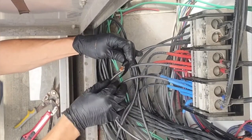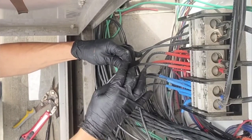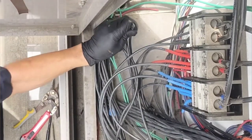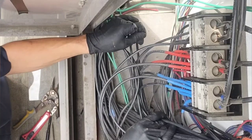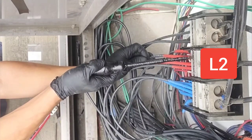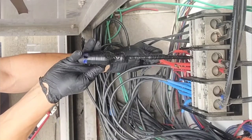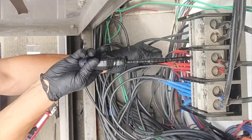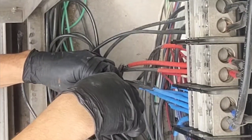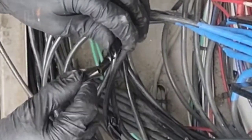If you're careful, you can do this sometimes. You just have to make sure when you're disconnecting and connecting that there's nothing running on that circuit. If you have something that's pulling current on a circuit and you disconnect it while doing what I'm doing right now, the moment it becomes a loose connection but still touching, you're going to have problems — it's going to spark, sometimes possibly extremely big, and that's how you get hurt. So always know what you're doing, make sure there's no current running through any circuits, and make sure nothing can be back feeding.